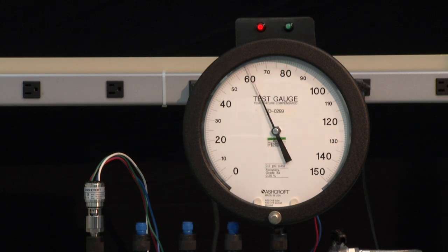We would drop the pressure back to 0, and then increase it up to just before 80 and walk it up slowly and measure the exact set point.